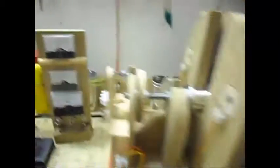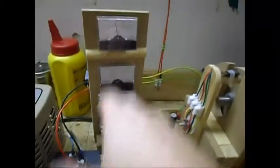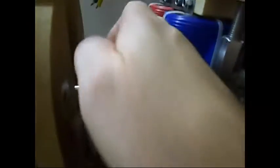I have the system running already. I'm running at around 12 volts at 1.5 amps, but the input is not important now. As you can see over here, the coils are still connected in series as the previous video. The two bottom coils are in series and the two top ones. I'm going to connect the transformer on the two bottom ones.